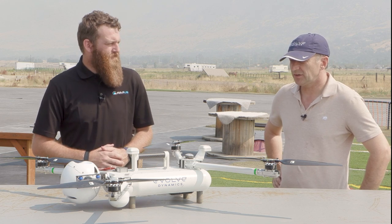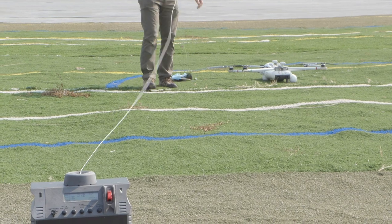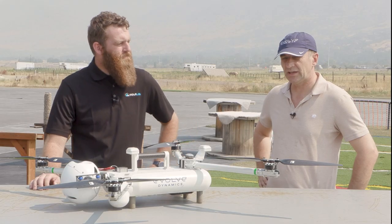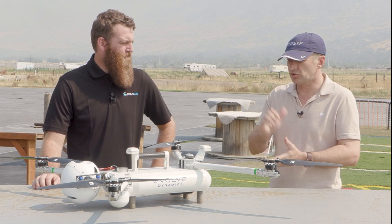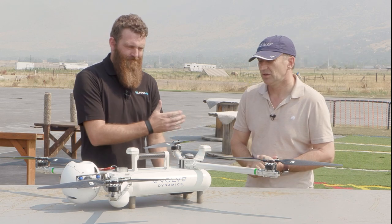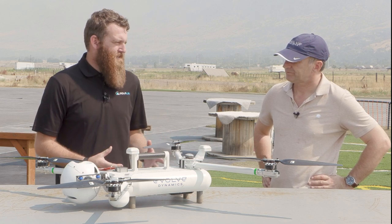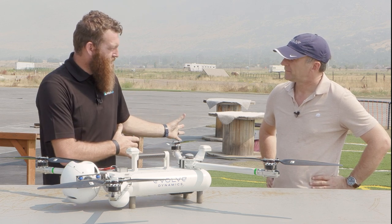To increase endurance further, we have a tether capability — the tether plugs into the bottom of the aircraft. It is literally a battery change to go from tether mode to non-tether mode. There's a hole in the bottom of the aircraft, the cable pushes up into the bottom, and you fly off with the tether. We've done a 48-hour flight with the tether. At any time, if you can't get the right aspect on because you're on the tether, you can drop the tether in flight and you've still got half a battery — about 30 minutes of flight time.